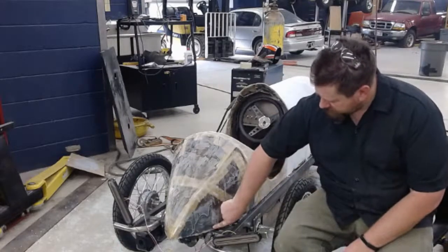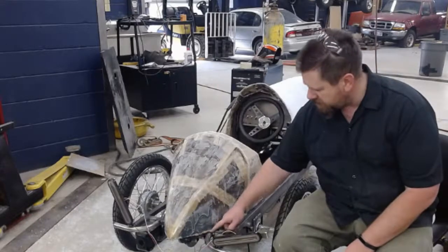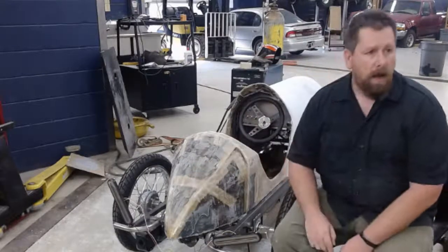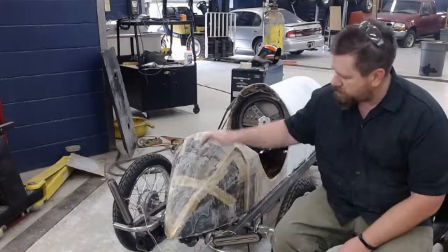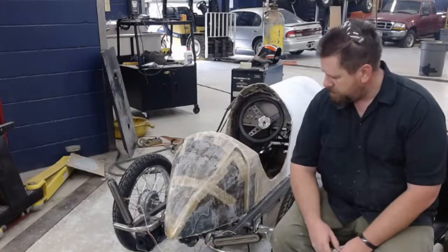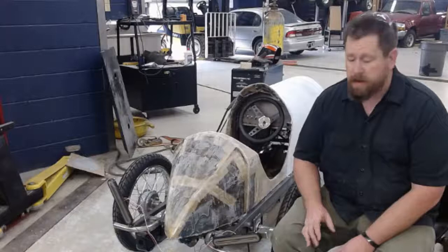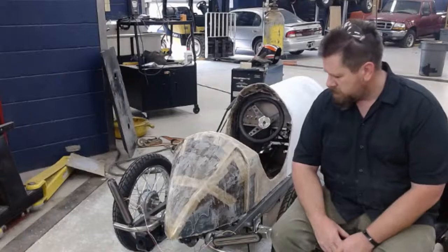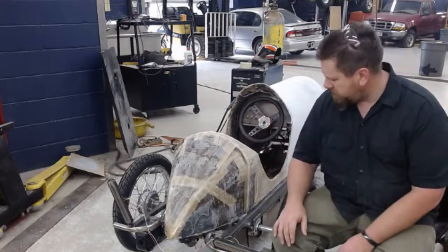The body panel sits here, which is just on the side of this bended pipe right here. I don't know how well you can see that. The other side does not. The other side tucks in. So I bent a metal tab, and I'm just going to slip it under there, put a tack on, just help pull that out. So that way, when I put the Bondo on, it will help give it the rigidity it needs. And then this way, I'll give it all night tomorrow to cure. And that way, when I pull it off, I'm going to unbury some of the screws that got buried in the Bondo. But that's where I'm at. So let's move on to welding on that little tab.